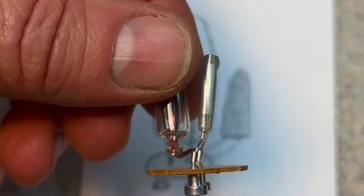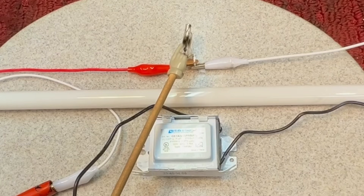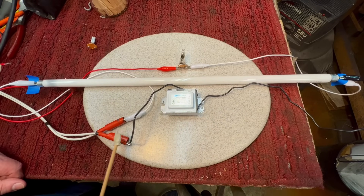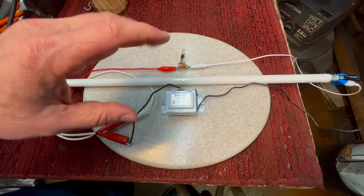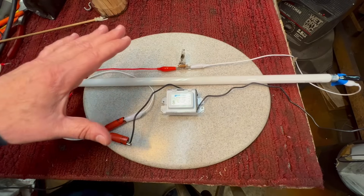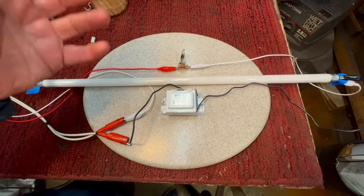Let me show you how cool it is when we hook it up to a demonstration. We have a magnetic ballast here, not an electronic start, so we have to use the starter. This is outside of the case so you can see it operate. It's hooked up to the end of the tube and to the power line. When I plug it in, I want you to see exactly what happens. And you remember the old school fluorescent lights — when you turned them on, they used to blink a little bit before they came on. That's because the starter is doing its magic. Old-time fluorescent light collectors like myself get crazy when we see blinking — we love that blink.